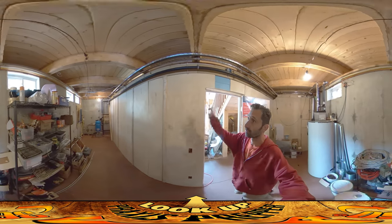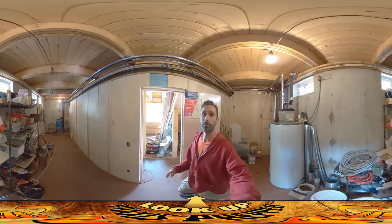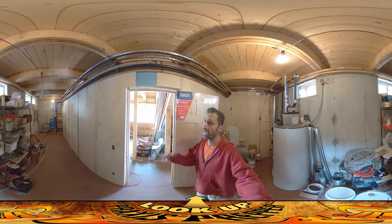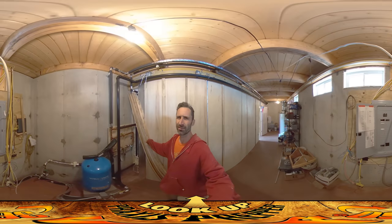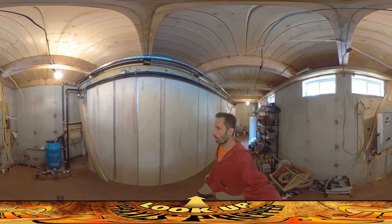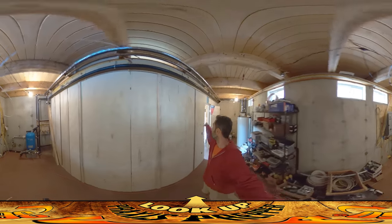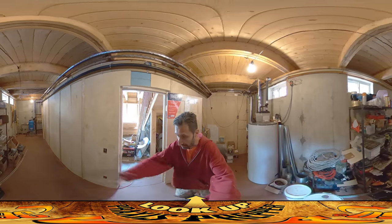The Luan is being held down by some strapping with four-inch long screws going through it. It's kind of floppy because I ran out of four-inch screws, but I've got enough to get the panels up. These battens — I think they're called battens — are holding them up against the wall. I've got eight more to go up, and I'll add more screws, but it's nice that the space is open now.